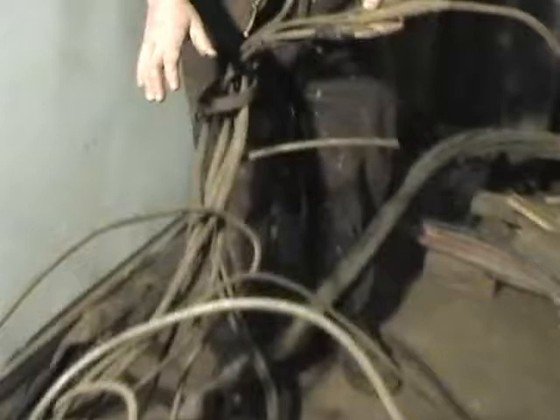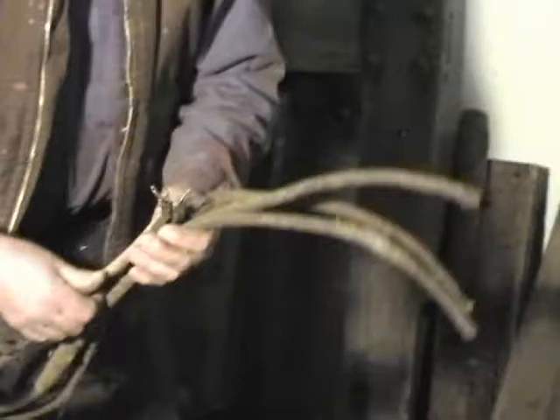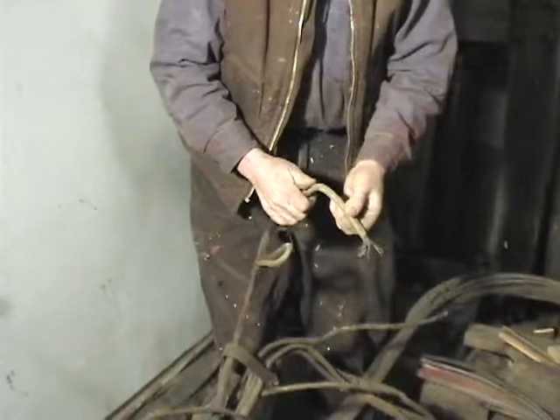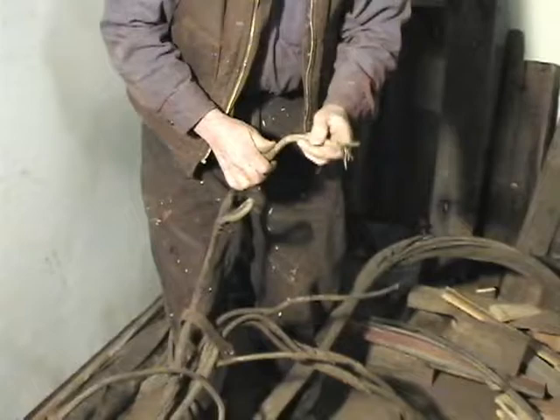This is the motor control wiring for ASL 100. It was all held under the car in various ways. The wire is rubber-covered, cotton-covered, stranded seven-strand wire — I think a number six wire. I've separated the strands so you can see. This wire has the advantage that you can bend it around places and it stays there. More modern flexible wire won't stay. The stiffness makes it a little hard to install, but as you're putting it on the roof it'll stay there quite nicely.